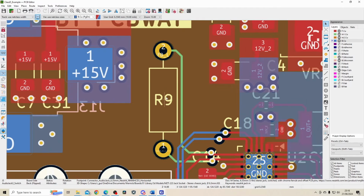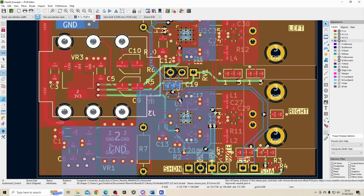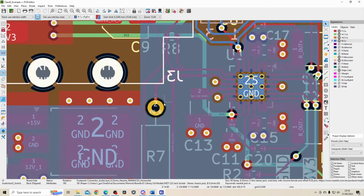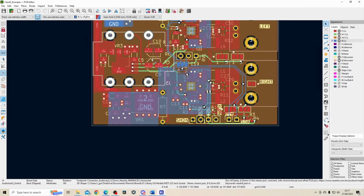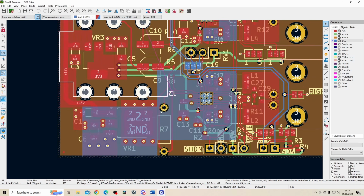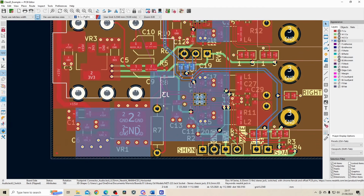And one of the other things you might notice, I've got some through-hole resistors on this, and this is to fine-tune the gain of the two audio amplifiers if I need to do it. I think in the next iteration I'm going to basically delete them because I'm not entirely happy with having these long tracks that are unterminated. Even at 20 kilohertz, which is not the highest of frequencies, it's not good design practice to have long tracks like this that are just floating. Another easier way I could have done this is added a 0805 resistor over here, but I don't have any resistors to hand. I only have through-hole resistors to hand, so this is why I put these on. I think that covers everything for the board.